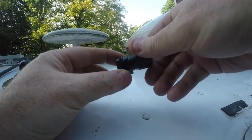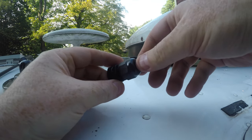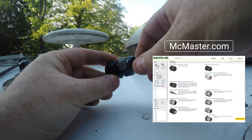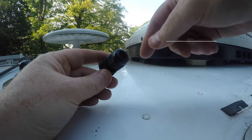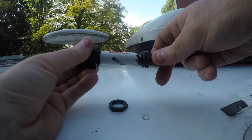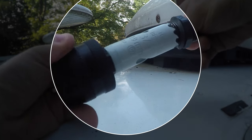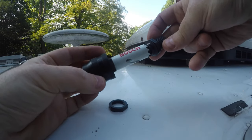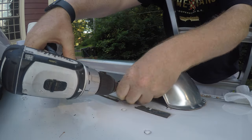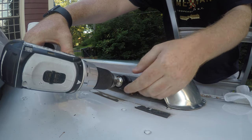This is going to work better than just a hole with a piece of caulk or tape. These are cheap — you can find them on Amazon in big collections for like $10, or order them individually. I think the best source is McMaster-Carr at McMaster.com. I had to find a drill bit that fit this hole, and none of my regular drill bits were big enough, but I did find a little hole saw that was just right — a Bosch three-quarter inch hole saw. I'm doing this a little blind. I want to be up off the bottom so if water runs down here it doesn't go into the hole, and I need sufficient room to put the cable gland in there.